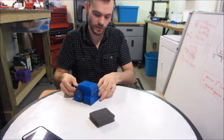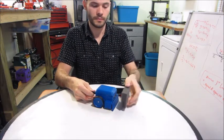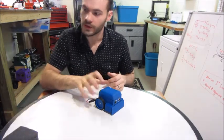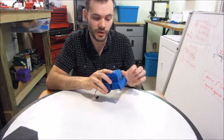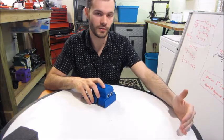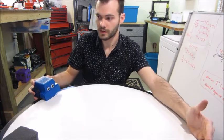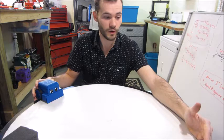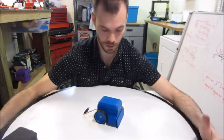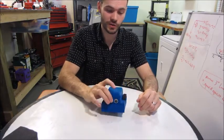The robot loves detecting my phone, as you can see. The total range of an ultrasonic sensor is between two centimeters and three meters, and you can easily adjust the detection range in the software. For my purposes, the ring is only 60 centimeters long, so I set it even shorter — otherwise people standing outside the ring would accidentally trigger the sumo robot without realizing it.